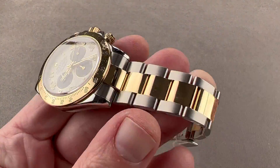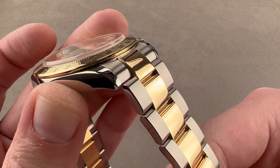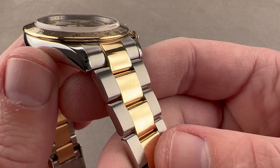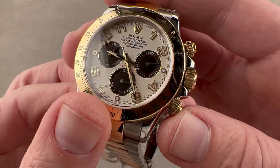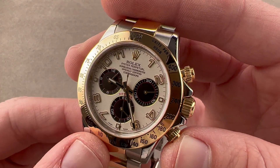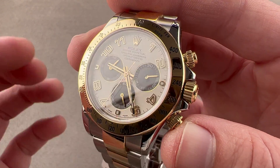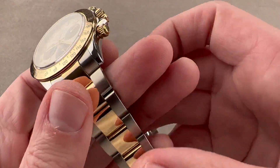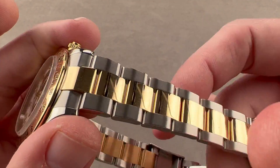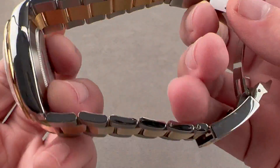Taking a quick look at the bracelet — Rolex has its own foundry. It makes its own cases, clasps, and bracelets. It also smelts its own gold and makes its own steel. The steel is 904L, a highly anti-corrosive steel. Whereas conventional 316 steel needs to be rinsed after exposure to sweat or salt water, this does not. The extra degree of resilience, including against some industrial acids, is a feather in its cap. The Oyster Bracelet features three links tapered down from the conforming end profile links, polished centers, satin flanks, polished outer faces, and removable links fixed by screws.